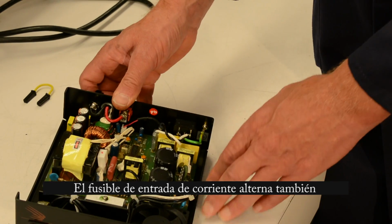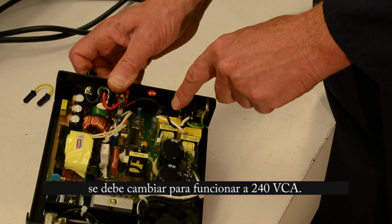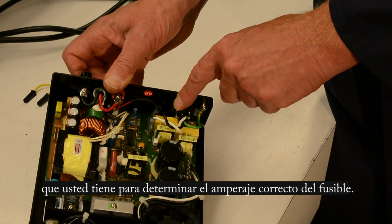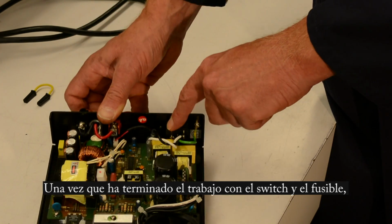Before you go any further, it should be noticed that the fuse should be changed from the 2.3 amps to a 4 amp. So that should be changed as well. You can go to Littelfuse and get a replacement. It's a mini glass fuse, you can see it right in the underneath there. So it's relatively easy to access. Once you've done that,